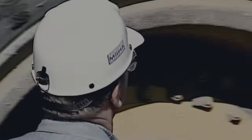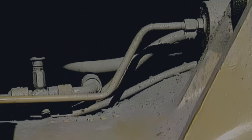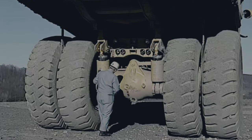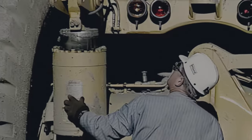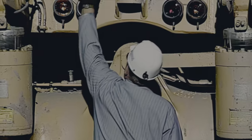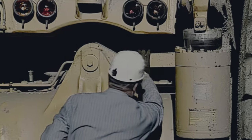As you move to the rear of the truck to continue your inspection, check the other tires and wheels. This inspection will include checking the braking assembly to determine if the brake valves, pressure converters and lines are secure, with no loose or missing parts, and looking for any fluid leaks. At the rear of the truck, you will also examine the truck bed for rubbing marks, cracks or other defects, such as broken welds, bed mountings or pins that might indicate problems in the operation of the truck. Check for lights and mountings, making certain the light units are clean and in good condition. Inspect the reverse backup alarm and mounting to ensure that it is not damaged. Check the exhaust system for leaks and defects.